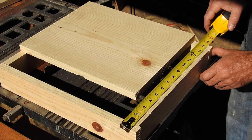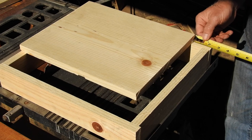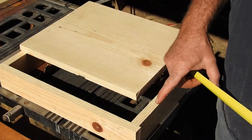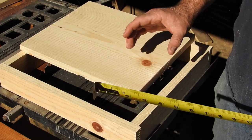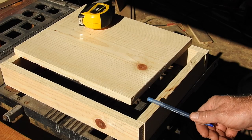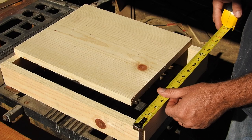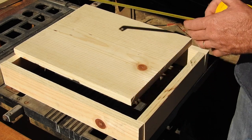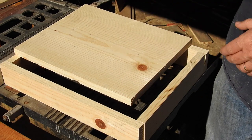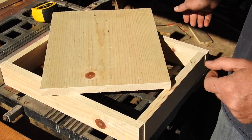So this is what we've got so far. The frame is about 14 and a half by 16, and my artwork is 14 by 11. This side has a two-inch difference; this side is three and a half and a quarter inches. I'm going to cut these down — two inches here, two inches there — and split the difference: about an inch and a quarter frame on each side. The side pieces are now approximately 11 and three quarters; total box frame is 13 and a quarter by 16. It is frame building time.